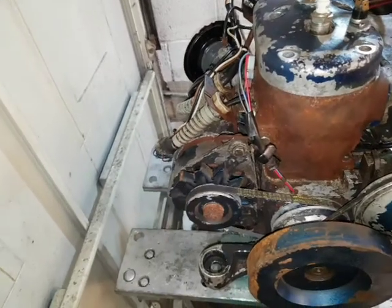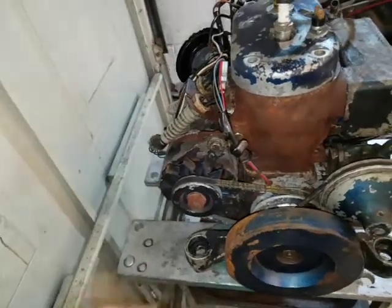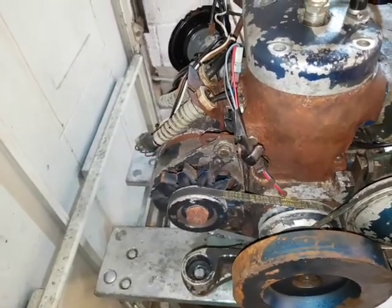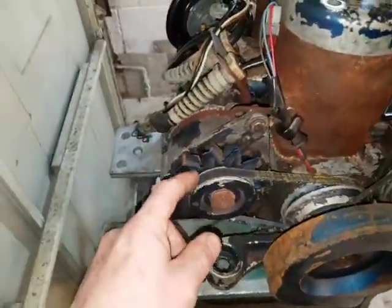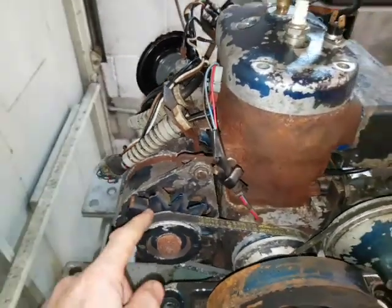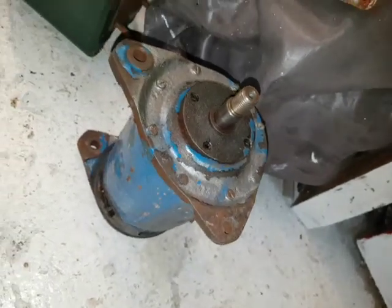Now if you had a Dynastart, it can't do that. It has a progressive drag or torque curve depending on the speed. It doesn't change much if the battery's flat because it's simply not charging at idle RPM. And so I don't think they've saved any weight with the combination. The other issue is that this doesn't appear to be a marinized alternator, and even if it was, the salt air is blown through the windings and corrodes the castings, the bearings and the windings like hell. On the Dynastart, there's no air going through it. It's protected against the elements. It'll last much longer on a boat.